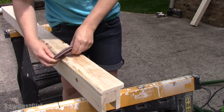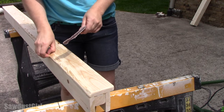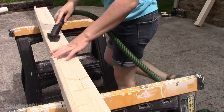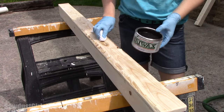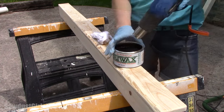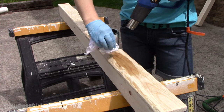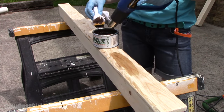Any areas that felt like they were going to chip off, I would go ahead and just rip it off and then sand it smooth. Once I felt sure I'd sanded away all future potential splinters, I vacuumed away the sawdust and brought over my finishing product, which is simply Brywax. It's easiest to apply when it's softened or even melted — on a hot sunny day, setting it out in the sun is usually sufficient. If it's overcast like it was when I was applying, I just hit it with a heat gun throughout the application process to keep it soft.